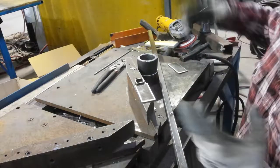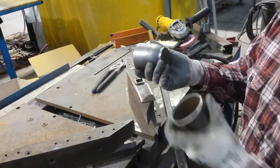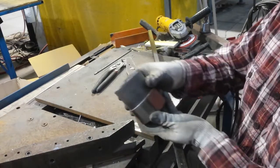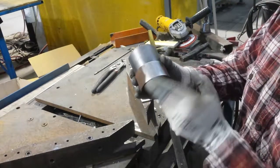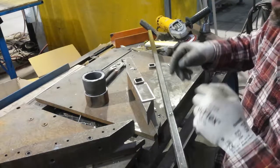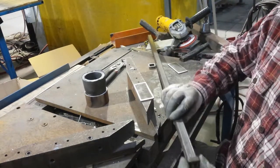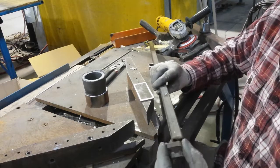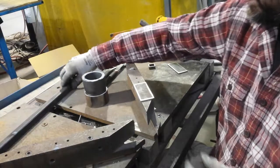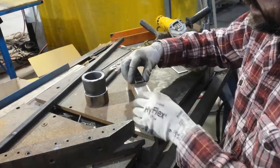What I've got here is an inexpensive crucible I got for casting aluminum. I've cut a piece of steel tubing that just about fits over it, but not quite, so it'll make a nice base. Now what I'm going to do is prepare two side plates with larger box sections than the piece that I'm intending to use to slide in and pick it up. That's my scheme. I hope it works, but first step, I'm going to have to weld these on.